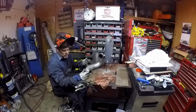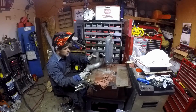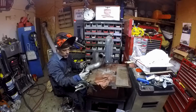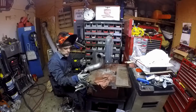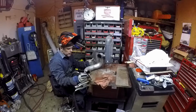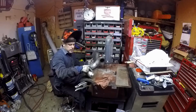If you've got a spare V-band that fits it and clamp, use that. But if you don't, whatever it's mating up to, like this, I'll hook up to the backside of the turbo, clamp it to whatever the opposing V-band is. Clamp it to that and weld the entire thing until it's cooled completely down. Weld it with that in place. You won't have a problem with the stuff sealing unless you just go crazy on the amperage and do dumb stuff. You still want to stitch weld it, do an inch or inch and a half.